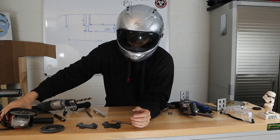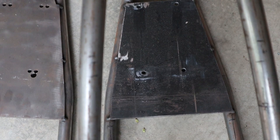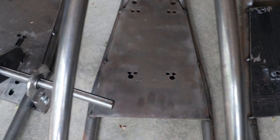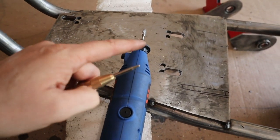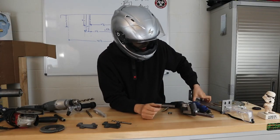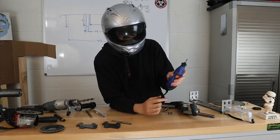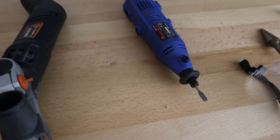I start with an engine plate. I just take a piece of quarter inch steel, take my angle grinder with a cutting disc on it, and cut something to size. I come back, do my measurements with the engine, and make my markings with cobalt drill bits. If I want to do a slide where I have adjustability, I come in with a tungsten carbide high-speed rotary drill bit. It goes really fast — sharp metal shavings everywhere, so make sure you've got eye protection.